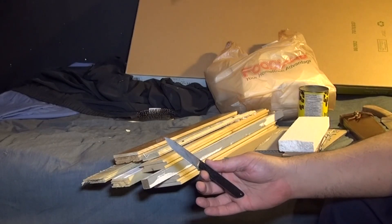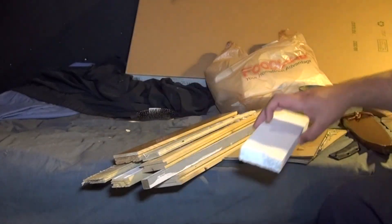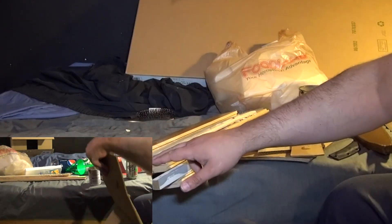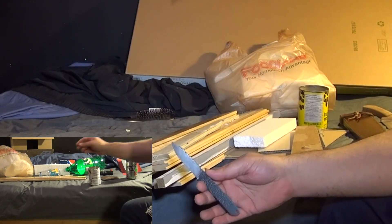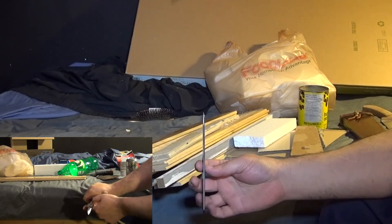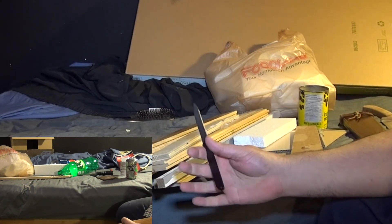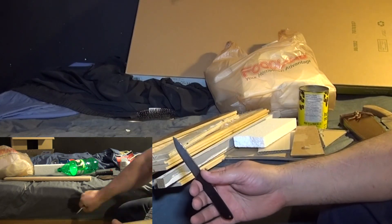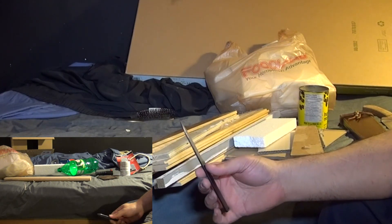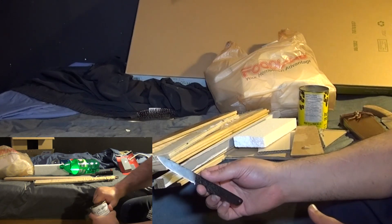I started off cutting some sheet foam, cardboard, pine, hardwood flooring, and plywood. I was using about 35 pounds of force on the handle. The reason I stopped at around 35 is because the handle is so thin, it ramps up the pressure very rapidly — at around 35 pounds this was hotspotting so bad I could only do around 50 cuts into the wood before I'd start to get discomfort. It's necessary to do a high volume when you're trying to figure things out like this, because anything can happen in one or two cuts. If you look at the cumulative effect of 50 cuts, then change something, and look at another 50 cuts, you can be decently comfortable that you reach a sensible conclusion.